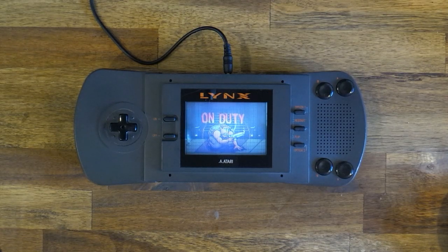If your LCD backlight is dim or dead, has missing pixels, or has lines through the screen, you can go ahead with this LCD upgrade. If you're missing one third of your image from left to right, you may have a more significant issue which a new LCD may not fix. If you have no signs of life at all, but you can hear the game audio and the game responds to key inputs, there's a high chance this LCD mod will bring your Lynx back to life. We'll start by opening the Lynx.